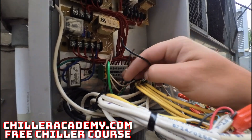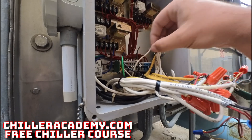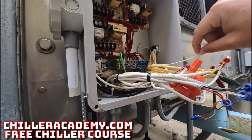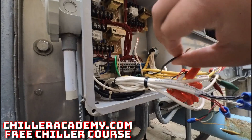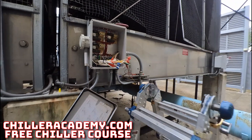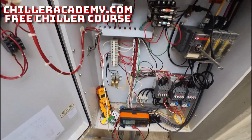That'll isolate everything from over here — we don't want any of these touching anything. We'll be able to test each individual strand with a megger to ground and see if one of these has a weak point somewhere in it. That's what I have a feeling is going on here. More than likely it's probably this makeup feed wire — it's only failing when the makeup comes on for a few minutes and then just bam. Maybe an intermittent short somewhere along those lines.